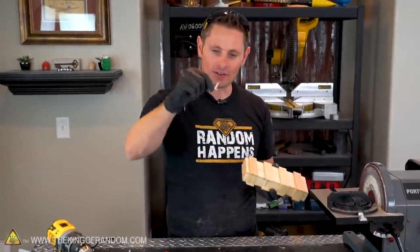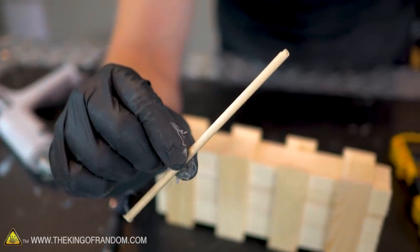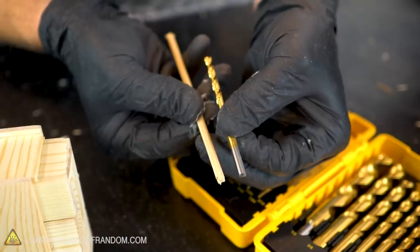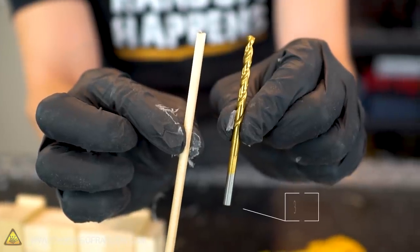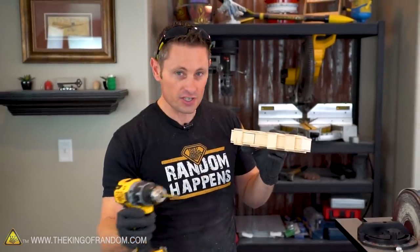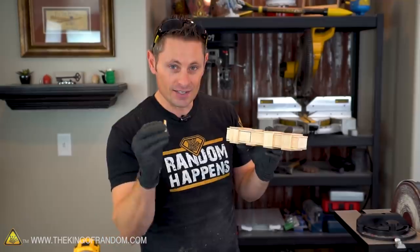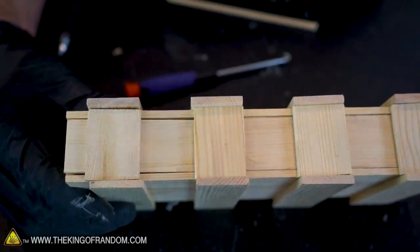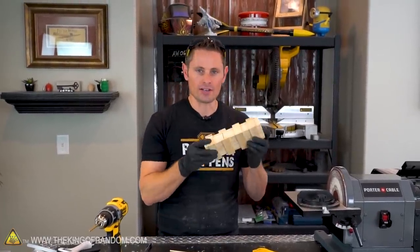Now it might start to make sense why we made that little screwdriver originally. We're also going to bring back our small dowel because we're going to cut off and use two small sections of it as well. We want to drill a couple of holes the same diameter as our dowel — a 3/16-inch bit seems to be about the perfect fit. Our first hole needs to be drilled very strategically into the smallest compartment, right on the edge near the seam line. It needs to happen so that when we put the flap on it's covered up and there's no evidence whatsoever. It's going to be most accurate if we drill the hole while everything is locked up nice and tight.